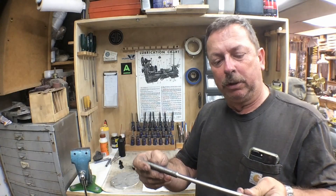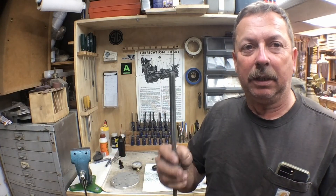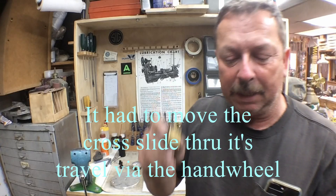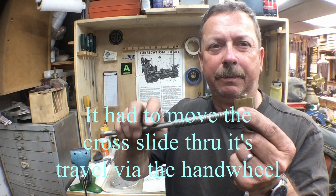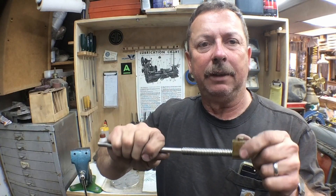It's a little bit shorter than the original lead screw that was on that saddle, but I don't think we need all that. This had to have adjustment through the Acme nut on it. This one doesn't, and of course there are left-hand threads. I shot a little bit of video on cutting these threads — these are a relatively tight fit.